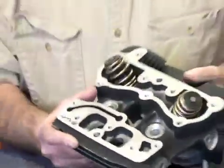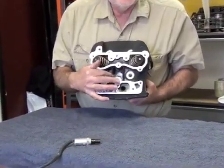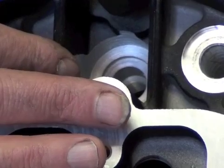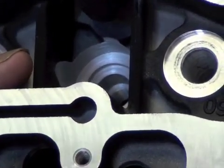So what we're going to do is we're going to go in back. I've got this head that I just machined and I'm going to go through and show you how to use the Harley-Davidson Screaming Eagle fixtures for drilling and installing an electric compression release.